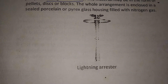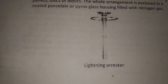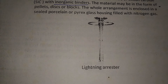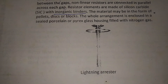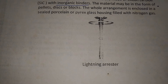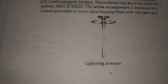Generally, the lightning arrestors are connected to costly equipment at 132KV. For a 132KV substation, on the incoming 3-phase line, 3 numbers of lightning arrestors are installed for protecting the inside devices of the substation, in front of the power transformers or any costly equipment, and also in case of the outgoing feeder outside of the substation. So the lightning arrestor protects the substation from outside surges on both the incoming line and the outgoing feeders.